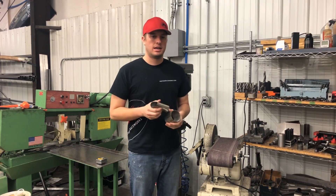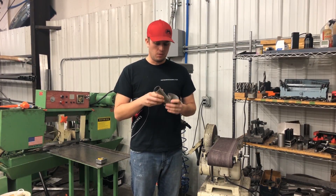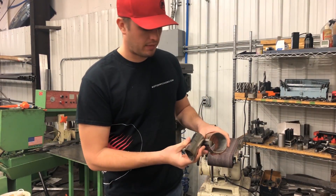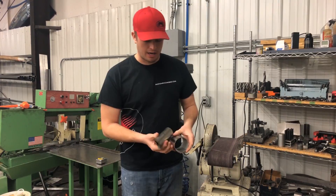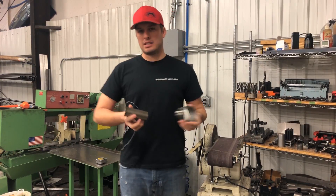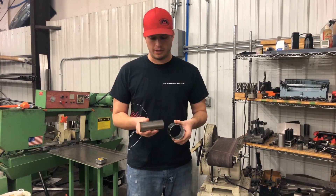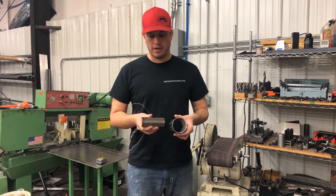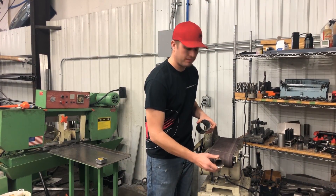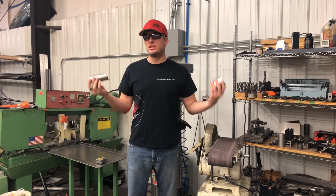So I'm going to show you how I grind the tube, how I mark it, and set it up — for instance putting a wastegate on there, where you have a different angle every time. What I'll do is just kind of hold the pipe up and eyeball how I want it to lay out, then draw a Sharpie mark as a reference point. This isn't an exact science. I've had dreams of making a tool that makes this really easy but haven't gotten around to it. If you eyeball it with a Sharpie as you run it on the grinder, you'll be able to dial in the pitch.